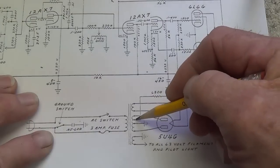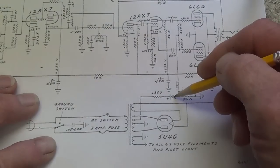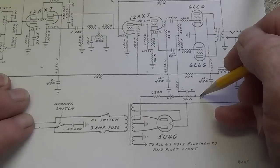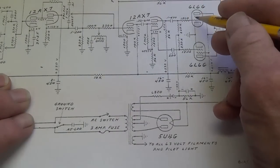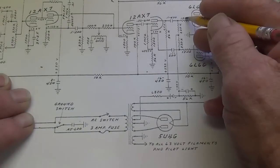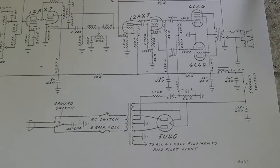We see here that from this winding in the power transformer secondary, we come up through a 6800 ohm resistor and through that diode that replaced the selenium rectifier. We see that the 56K resistor must be correct. The electrolytic filter cap is working properly, and we're getting a balanced negative DC bias supply delivered to our tube grids. Since it's balanced, the 1500 ohm and the 220K ohm resistors must both be equal in total resistance, so we can rule that out as a cause of the problem.